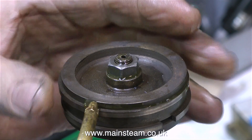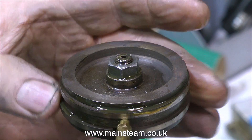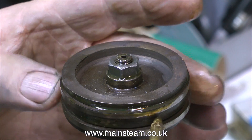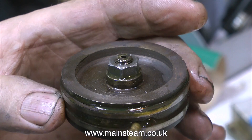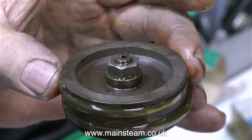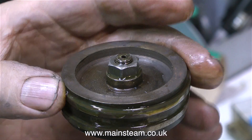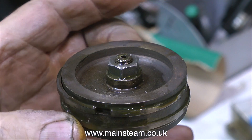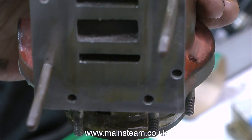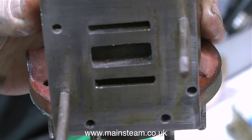Once the piston is secured to the piston rod, the next thing to do is thoroughly oil the piston rings. I'm applying quite a lot of oil, because I need them to be very oily. For this I'm using my own recipe for general purpose lubrication on steam engines: approximately 50% steam oil, 25% machine oil to thin the steam oil, and 25% cold pressed extra virgin rapeseed oil from the supermarket. In the railway days this used to be called 'the special stuff', and it is a really good friction reducer.